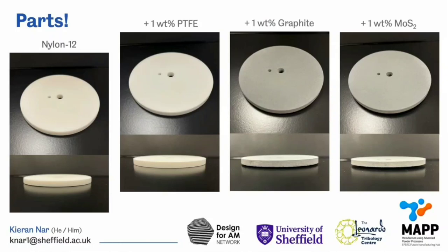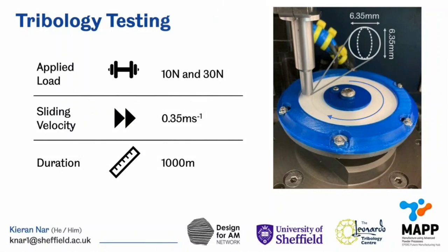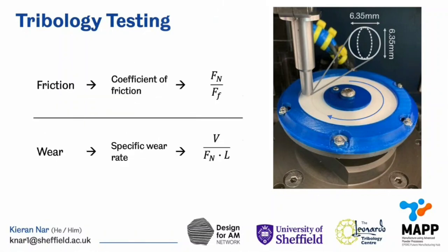To my excitement, we were able to build parts. Now that we have parts, how do we go about measuring the friction and wear properties of these samples? Well, there are numerous ways to do so, but the testing configuration we decided on was by using a pin-and-disk setup, which simply put is a very advanced record player where the vinyls are our laser-sintered samples and the needle is our contacting steel counter body.